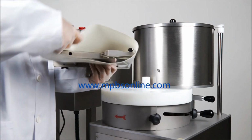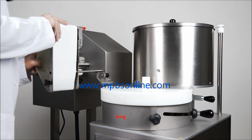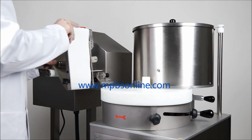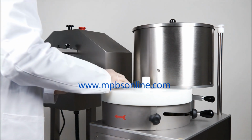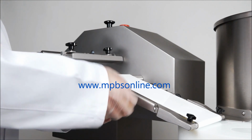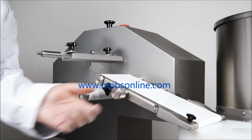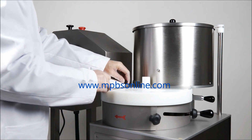The inclined conveyor belt is then placed in position, mounting it onto the two shafts to be found on the right of the machine structure in a completely vertical position. It is then pushed downwards until fixed on the positioner and is secured with the stainless steel nut. The housing, which allows the portions to be extracted, is then assembled and secured with the two nuts.